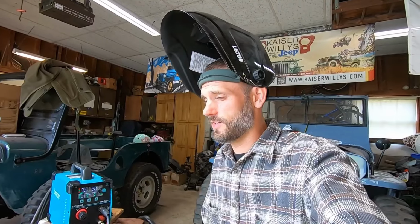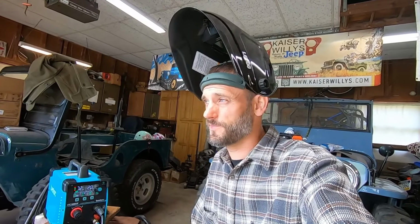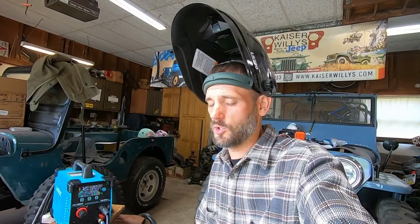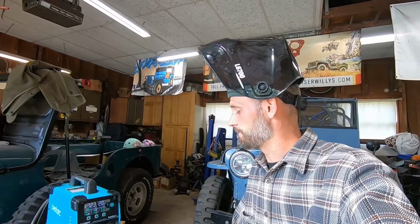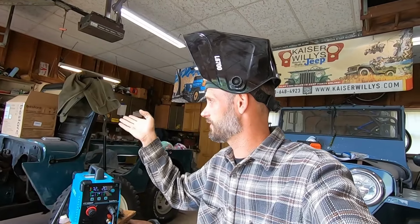So that's why it's interesting, because I can weld, you know, at 120 amps, probably 110 amps all day on 110 with my Eastwood MIG, and it's fine. But the plasma is hard on the breakers. So that could be the extension cord, or you know, my compressor. I don't know what circuit they're on.